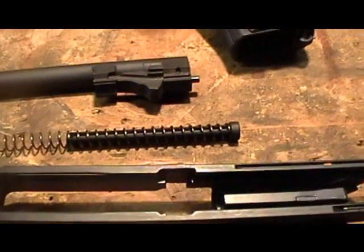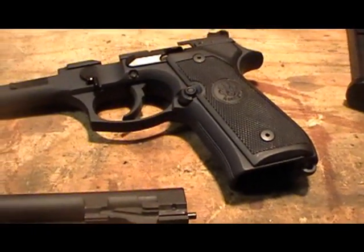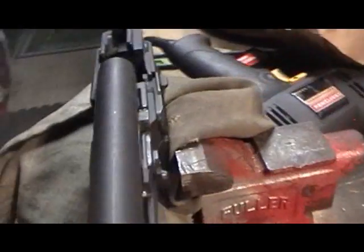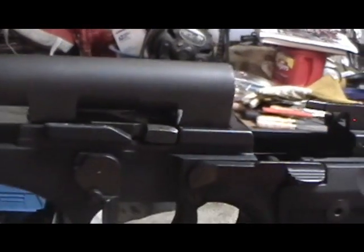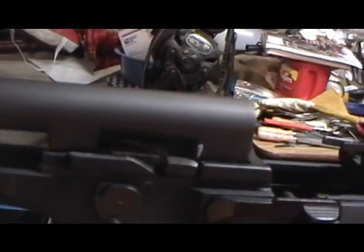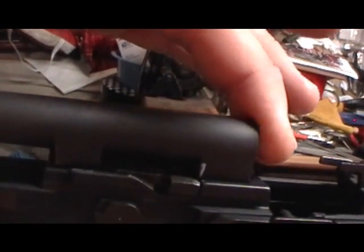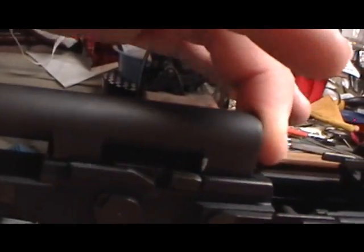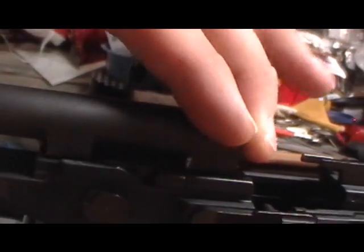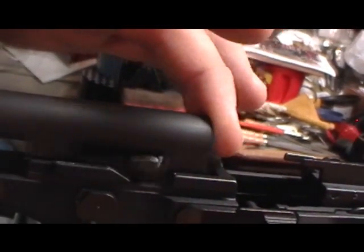And I can see on my Garand where my op rod will rub sometimes is a critical place for it. I think we can kind of see this. This is one of the things that I like to do. Maybe this will help a little. Is get it greased up and then put it in the frame and kind of twist it. There's a little bit of play in here which is going to be needed for operation, but kind of twist it side to side, lean it a little, get that grease working in, all the friction.